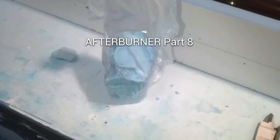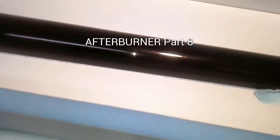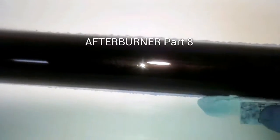I've got my modelling clay, and I'm just going around filling that final little tiny hairline crack that's in there. Just slowly going around and working it into that gap. That will give me an absolutely tight joint around there, so none of the tooling coat is going to leak through when I actually put it on here when I'm moulding it.